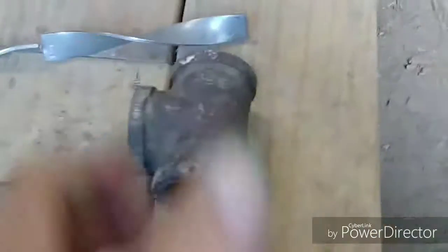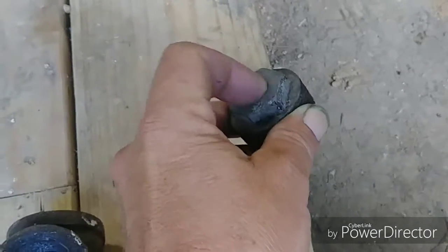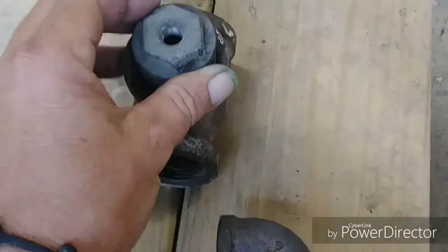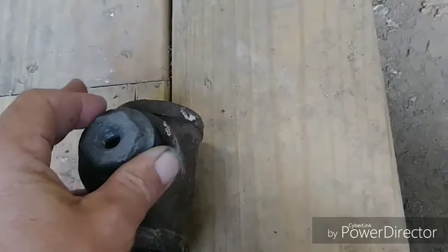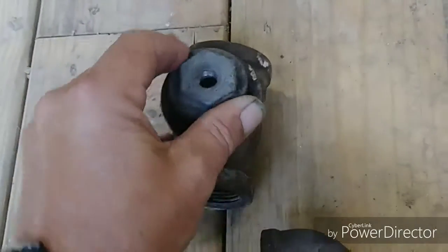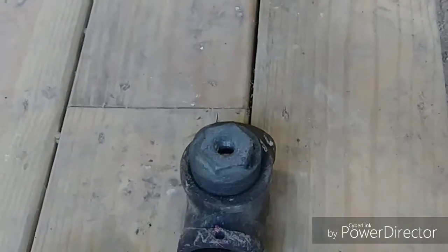Here we have it in pieces. We have our main body, and this here is an inch-and-a-quarter by three-eighths bushing. I stripped that out and had to drill it out, so there's going to have to be some more finagling there. But that will go in this top piece — all this will have to be pipe doped because gas will be introduced at the very base. I want that gas moving together so it mixes thoroughly for good even fuel usage and to burn even hotter.